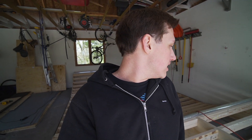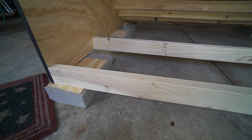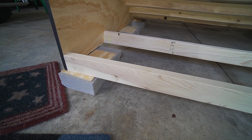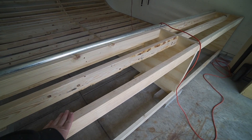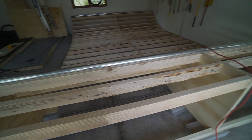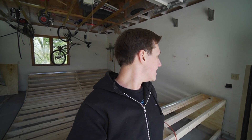I know you're probably thinking 'just wait until you start screwing on the deck — there are thousands of screws' — but I'm really glad the leveling is done because that was tedious. I used pavers to level it and then made micro-adjustments with different sizes of plywood sheets. The first order of business now is getting the deck boards on top, which will clear up some of the plywood and give me more room to work. The garage has been getting a little cramped, and I'll be glad to have this finished.